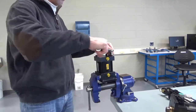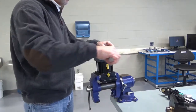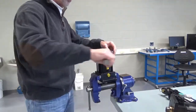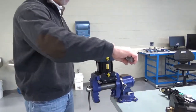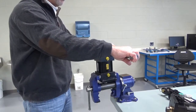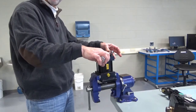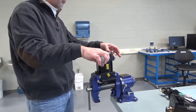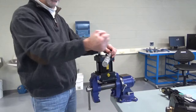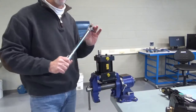Then you take it and just tighten it up until you hear the click. It's a very, very light click. So you keep torquing the nut with the wrench and you'll feel it break away just gently. You're starting to get tighter, and it's not going to take much — 17 foot-pounds is not a lot. You get that break away right there, that's all it takes. There's no need to hammer down real hard. It's like pulling a 17-pound weight with one foot of extension on it. You break away and that's all you need to tighten it.